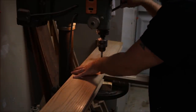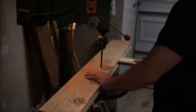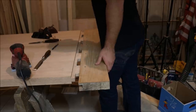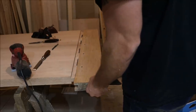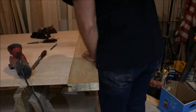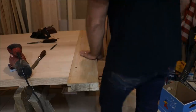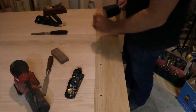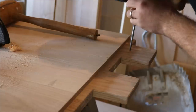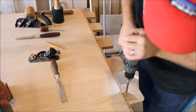I know this is a power tool, but unfortunately the three-eighth bit in my bit and brace set is a little bit too big, so when I put a three-eighth dowel in it shows an unsightly gap. That's why I'm using a newer bit in the drill press to get a nice tight fit. Now I'll install the breadboard on the tabletop and use a brad point drill bit to make a mark on the tenons. I then take the breadboard back off and move that mark around a sixteenth of an inch towards the shoulder line. This technique is called draw boring - it offsets the two holes, and when you drive a dowel through them the joint actually pulls itself together super nice and tight. This technique can be used on almost any mortise and tenon joint, but it's perfect for the breadboard because you cannot glue the outer tenons, and therefore the dowels will provide that strength and keep the joint nice and tight.